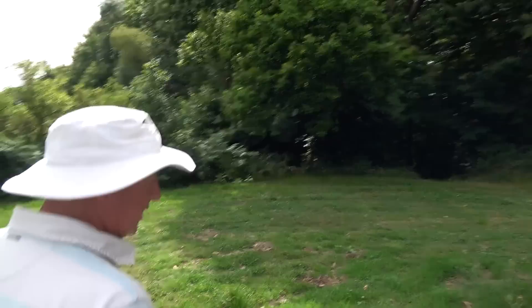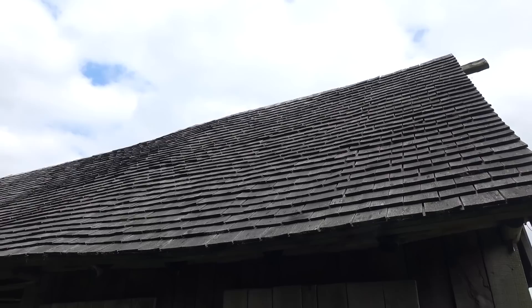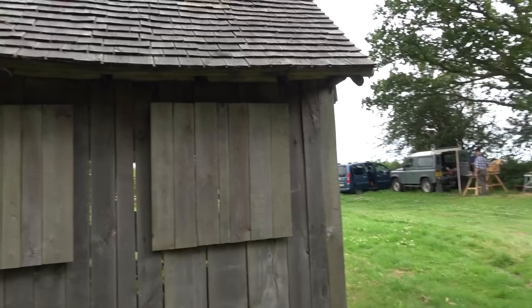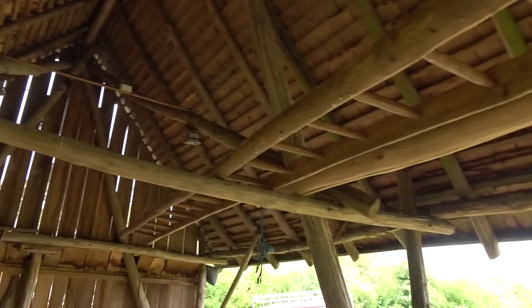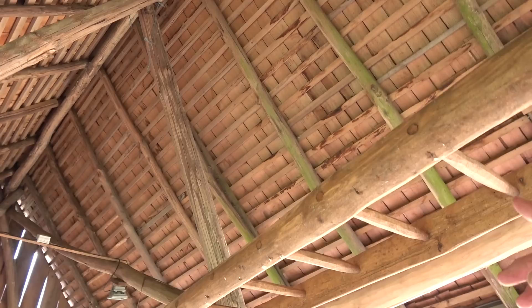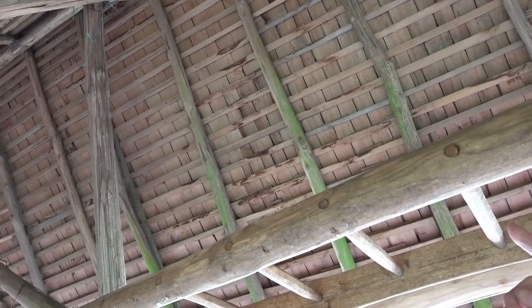Now if we come around the other side of the barn — these are sawn, same size but sawn on a wood miser, and you'll see they're a lot flatter. I don't like them as much actually. The interesting thing about the shingle is that the handmade, cleft one is meant to be more durable because you're basically pulling apart the cells of the wood rather than cutting through them. And inside we've got a very good example — you can see there's hardly any tannin at all coming out of the chestnut shingle on this side.